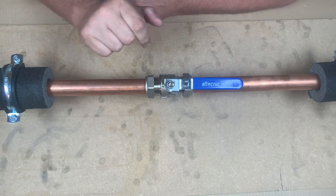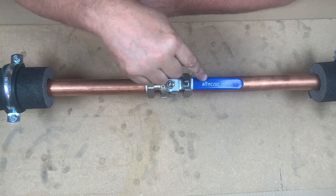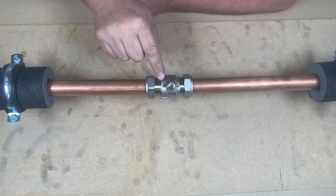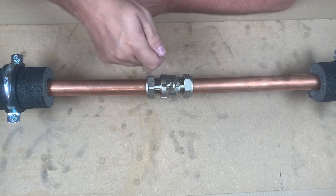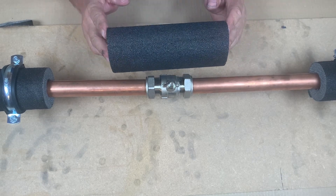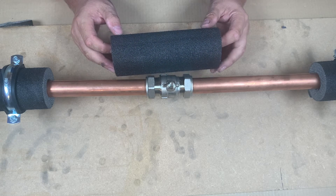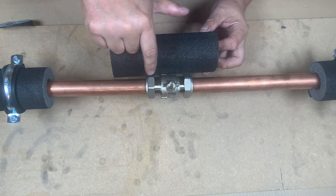The first thing you would do is remove the lever. Once you've removed the lever, you've got this area where you then measure, and that will be a cut onto your insulation so it allows the lever to turn on and off freely. Then what you do is cut a length of the Primary Pro insulation and take that measurement from around the valve.